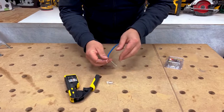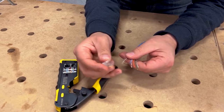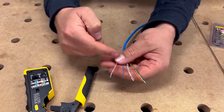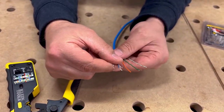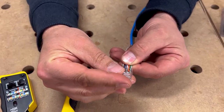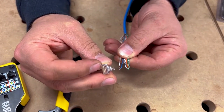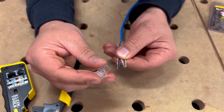There are two ways to install the wire in here. You can do a sort of cheating way, which is you remove more of the sheathing so you have a longer length of wire and you insert each wire individually. The other way, which takes a lot of practice, is you put all the wires together in the order that you want and then slide them all in at one time, making sure they all come out the other end exactly right. We're gonna do the first method just because it's a lot easier.